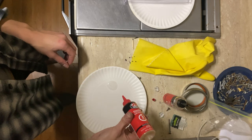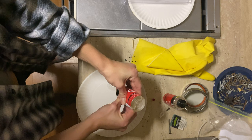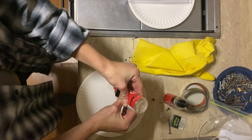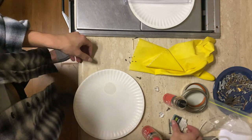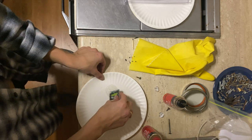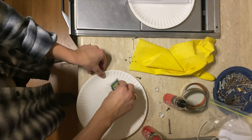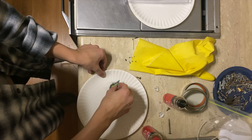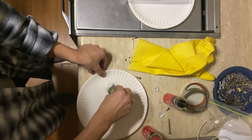The key is to use a disposable container and mix equal parts of the base hardener and the epoxy resin. Then you want to grab some other type of random disposable thing to mix up the resin and the hardener very thoroughly for about a minute. And then you want to work pretty quickly from there because it does start to harden a couple minutes after you mix it.